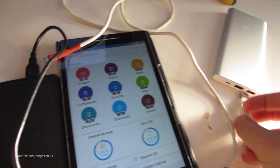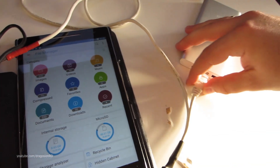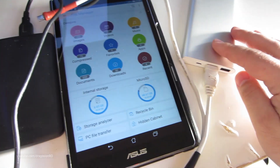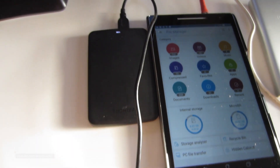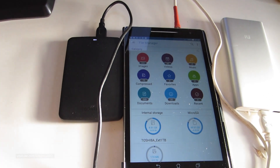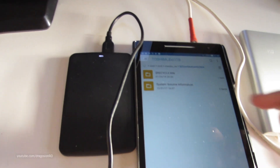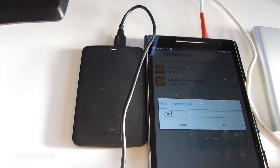Here is a good demonstration of the USB rule that says you have to flip a USB connector three times before you get it right. Ok, now finally it's connected. As you see the hard disk powers on a little, but since there is no data — it's only connected to power — it powers off and goes into standby. Now after we connect the power bank we connect the tablet and the magic happens. The tablet can use this external hard drive which would normally not work with this tablet or any other tablet or mobile phone, because normally the tablet doesn't provide enough power for this hard drive to work. But now we are using it on the tablet and we could even use it on a phone — that's pretty useful sometimes.